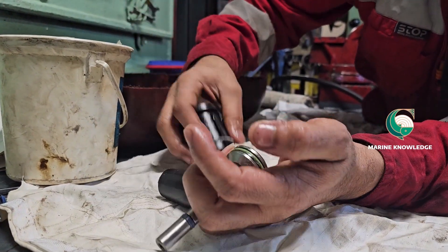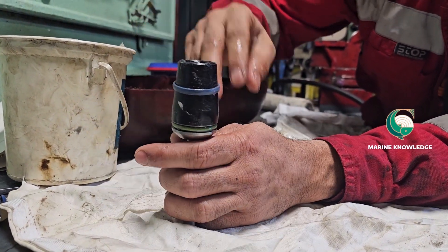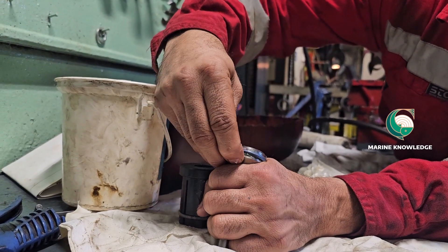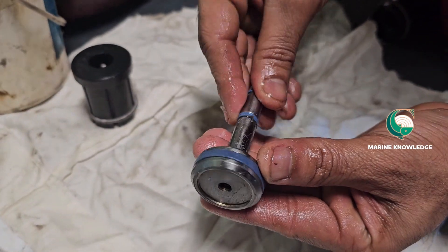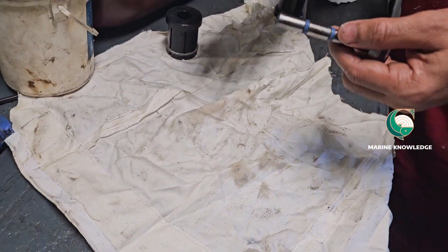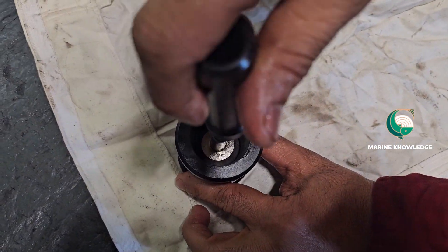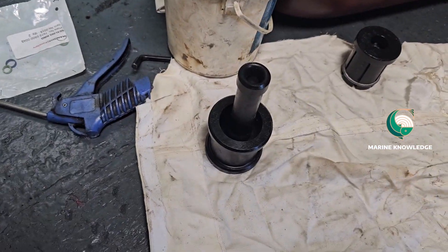Be careful when handling the air piston because since it is very small it should be handled carefully. Push it — once you are pushing, the seal ring is in place. Ensure it is properly in place. You can see all three seal rings are in place. Finally, use the compression tool to keep them compressed — this is the top piston compression tool and another for the spindle. Keep it like this for about five minutes so the seal ring and O-ring will be sealed in place.